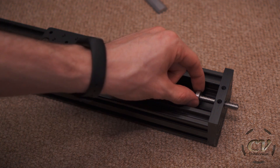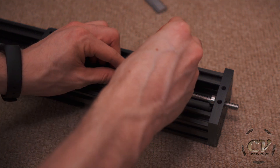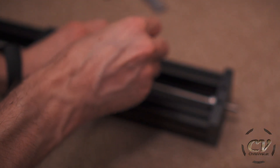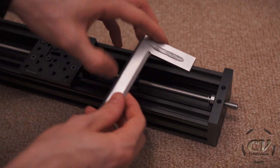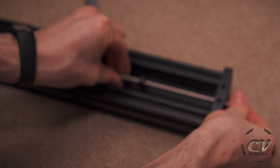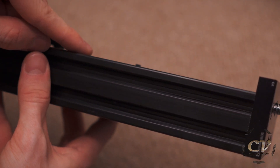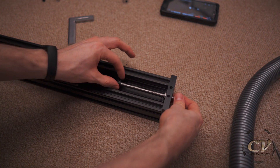As you can see, the lead screw will be held in place with a bearing, then there is a precision shim, and then there is a lock collar. But the problem with this is, if you screw it in place and then place something on top of it, you can see that this thing is getting moved, because this screw is penetrating the surface level right here — perfectly visible. So that is a problem that needs to get addressed.